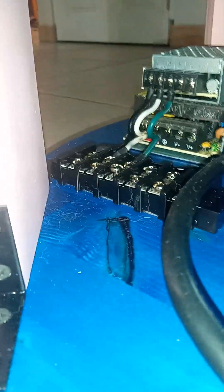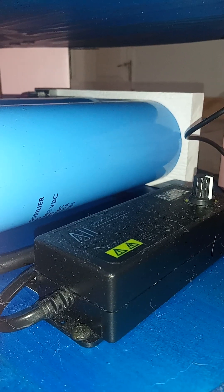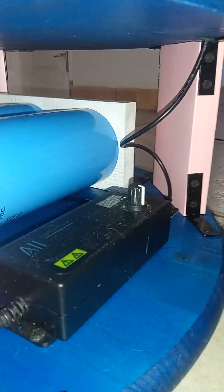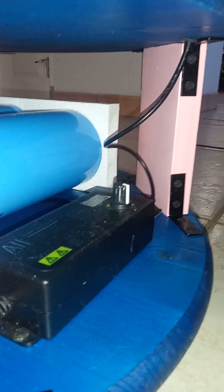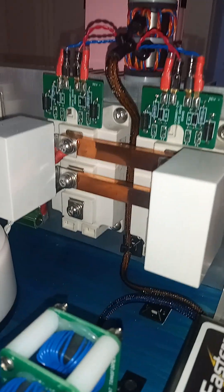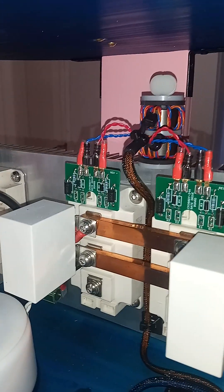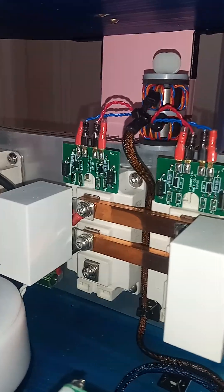You have your 5 volt and your 24 volt on the bottom, but the mains right there are connected and I just need to run that up. Your driver power supplies right there are 24 volts — adjustable. Usually the UVLO will kick on at 20 volts, and your driver is all connected and the phase lead is there and already wired up correctly to the gates.